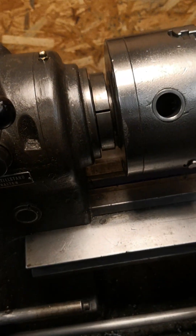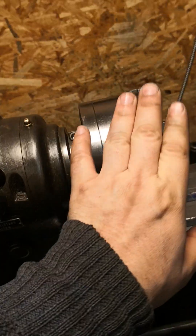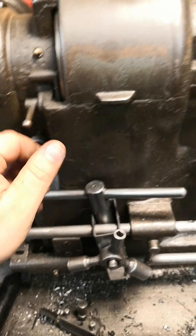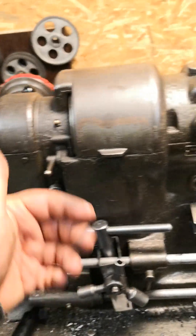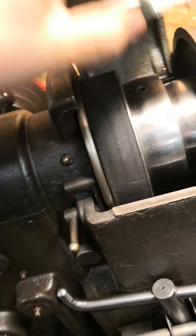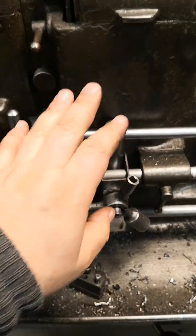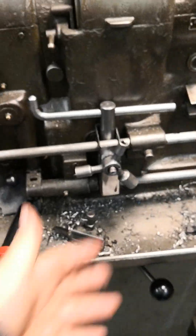You can blockade this here so you can unlock the three-jaw chuck. You have to unscrew this screw before you do that — this is a security clamp ring, it clamps the chuck to the spindle. Just disengage this nut when you're done so you can turn the spindle. When you don't disengage the thumb screw, the belt will spin but not the spindle — so you have a polishing belt inside there. It will polish your collets or your reduction rings. I made this last week so I can put my most-used stuff here.